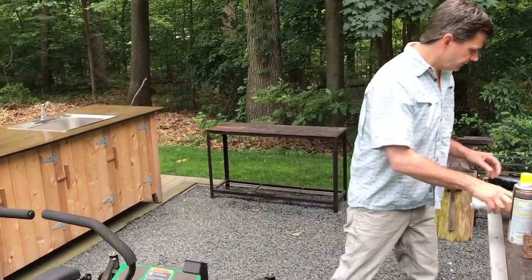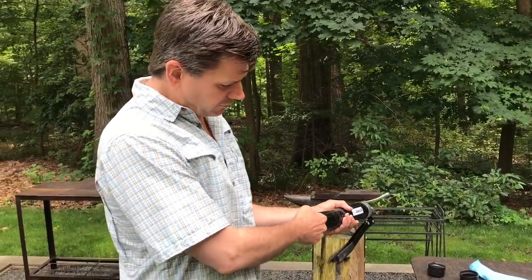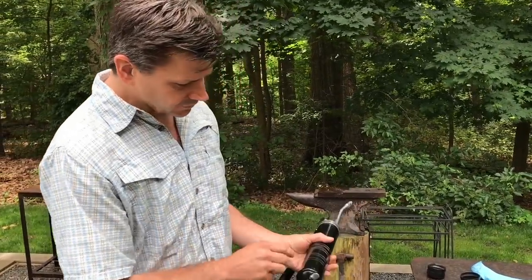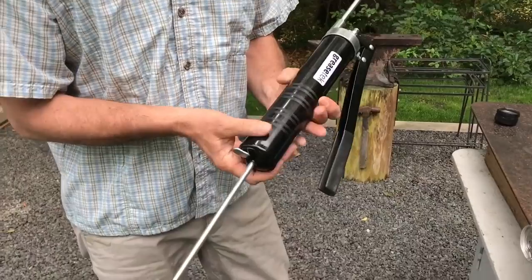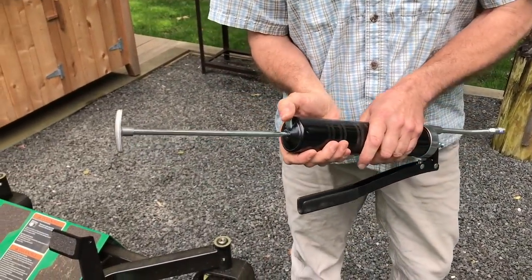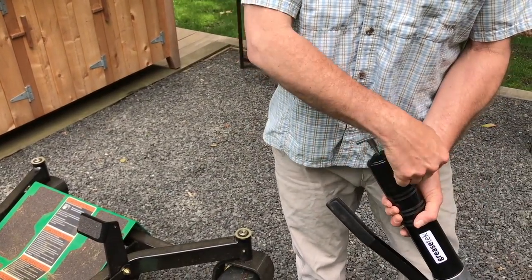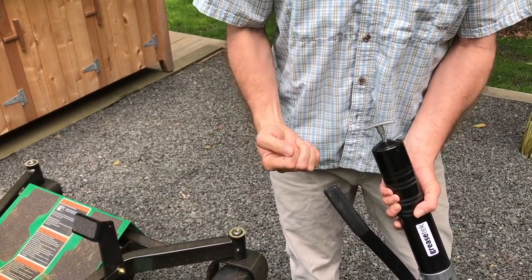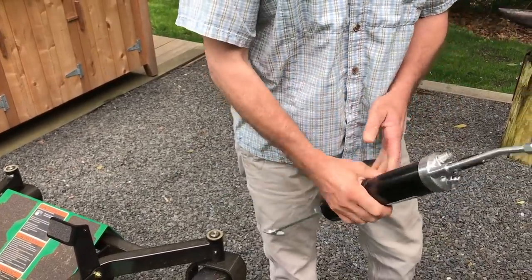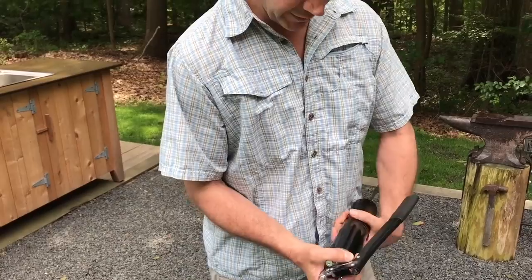The first thing I'm going to do is show you how to load a grease gun. If you've never done this before, it's really simple. You're first going to pull the plunger out — this one's got a little knob here and the plunger stays out. If you hit the knob you can see it goes back in. Some of them have a little lip where they get stuck, but anyway, pull that out and open the top of the grease gun up.